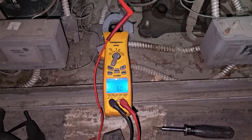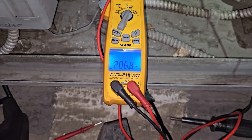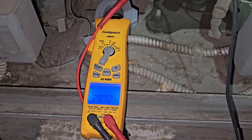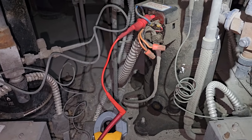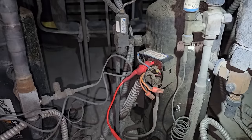Let's go ahead and test voltage. 207. 207. That stinks. I checked all three legs — we've got three-phase power. That compressor sounds like death right there. So let's turn off power and hope that this guy's off on thermal overload.